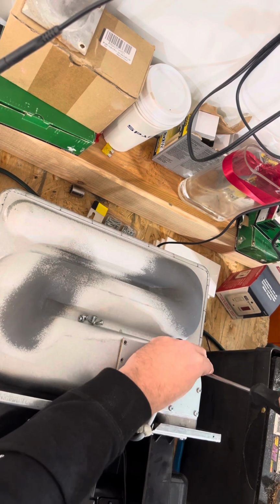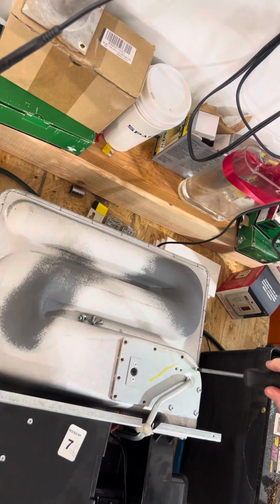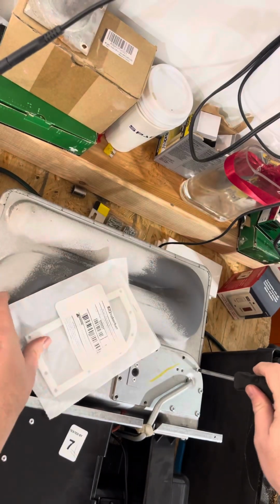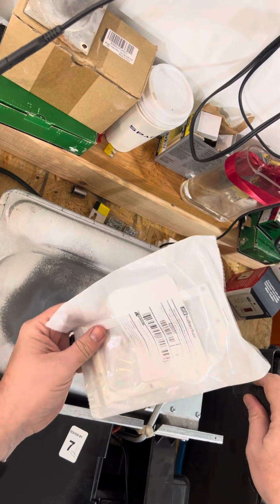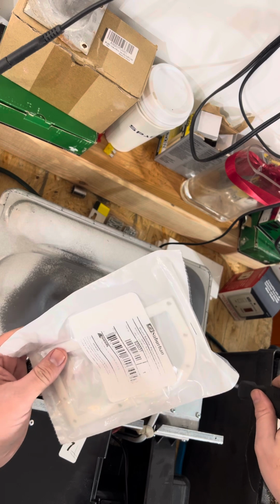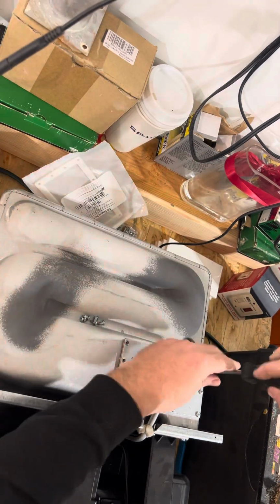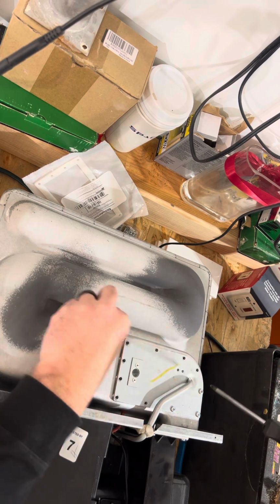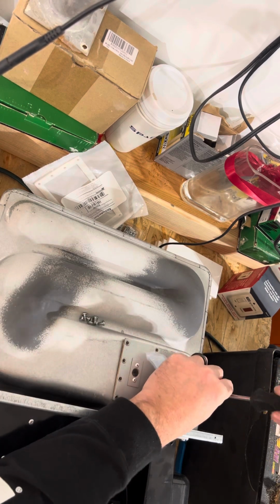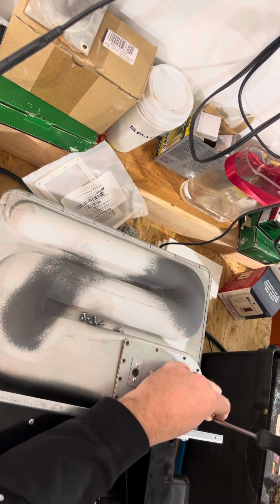When you remove these burner covers, you need to replace the gasket as well. And here's the gasket, part number 525031. I'll put a link in the description where you guys can get these, as well as the burner. We stock a lot of them because anytime we take this off, we replace the gasket. It doesn't matter if the gasket is a day old, we'll still replace it.